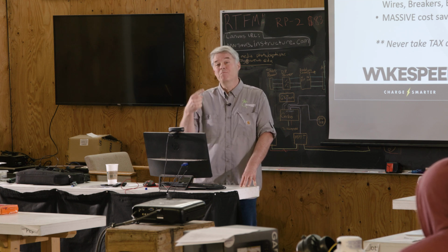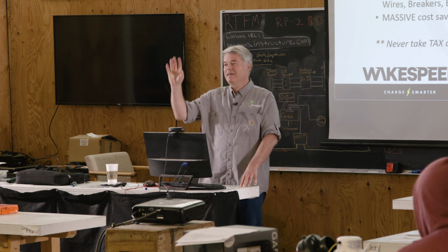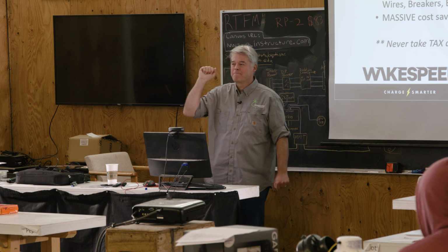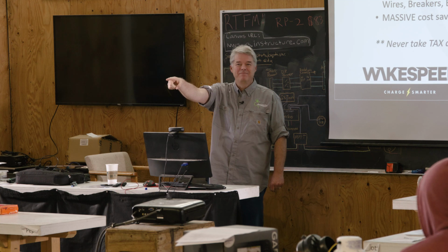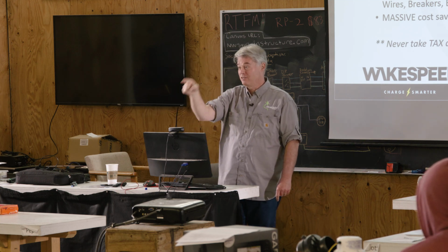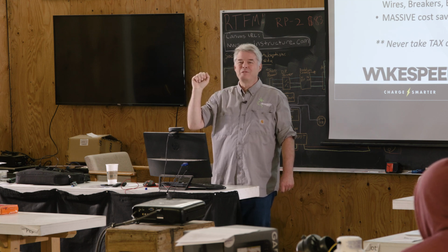Curiously enough, May is often my highest energy producing time. Can anybody guess why that might be? There's 2 reasons. Yes, ma'am. They're cooler. That is absolutely one. Did anybody hear what she said? They're cooler. Solar panels are more efficient when they're cooler. That's absolutely correct. What's the other one? Same position of the sun in the northern hemisphere. It's related to the sun, but it's not the position.